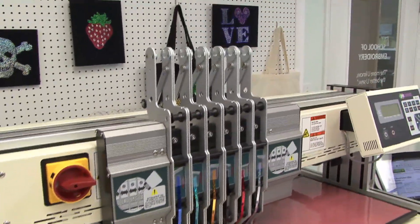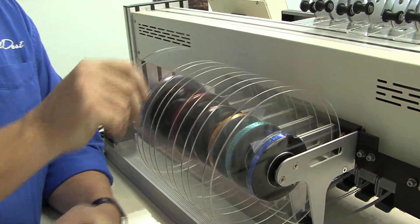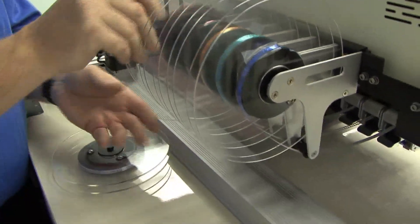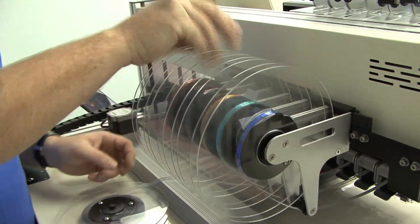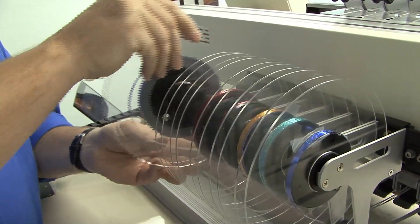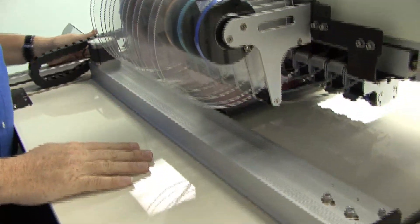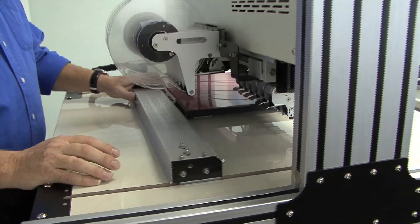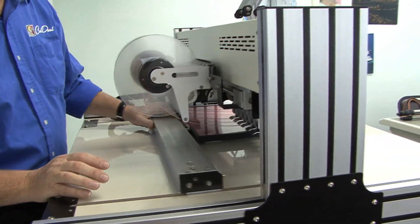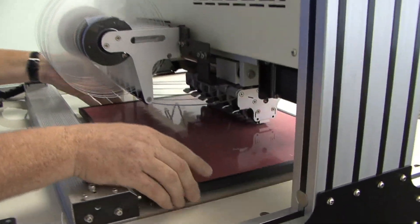Once that's done, come to the back of the machine. Because the machine is shrink-wrapped, the waste reels may be sitting flat on the table — set them up in their spots. Then inspect the machine for any damages from shipping. You want to move the frame forward and backwards to make sure it has free motion, and also left and right.